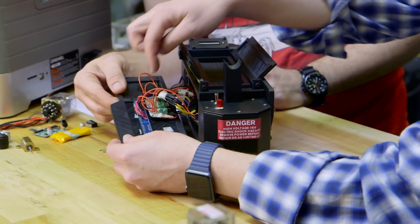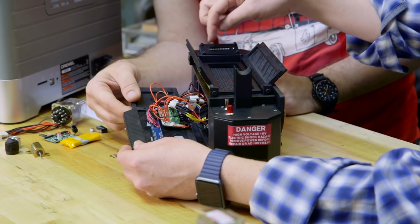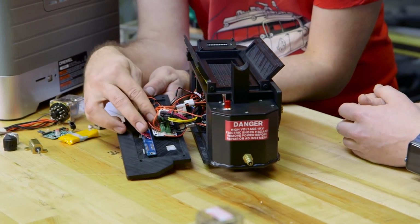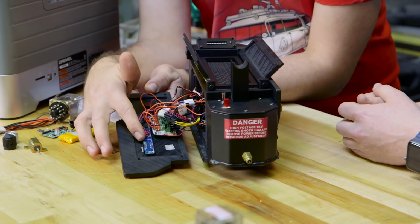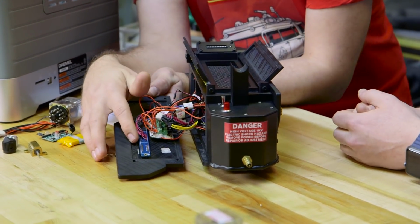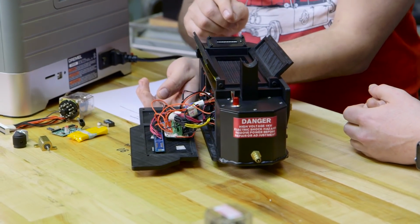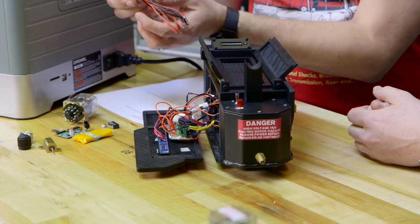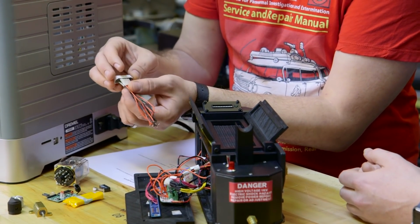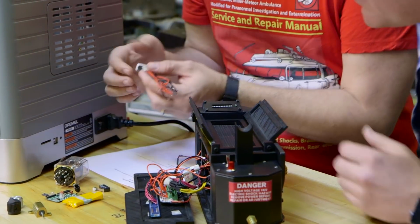So that control board is right here. Yeah. So it requires just a few cables from the Arduino. Otherwise, you'd have to run wires for every single LED. We should point out that the way this is supposed to work is the bar graph is supposed to be hardwired to the board that's right here. Yeah. And it accommodates 2. But I realized that there's going to be no way to put that up there. So I ended up, it was the most terrible wiring portion, wiring all the individual wires to the pins and then running them the whole way to the board here. But it worked.